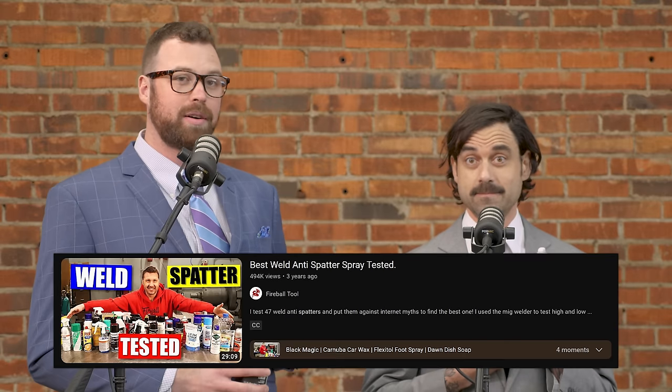What anti-spatter spray do you guys like? Pam? No, come on. Weldmark by Dynaflux is my personal favorite, followed closely by WeldAid if you can't find Weldmark. There are lots of anti-spatter sprays out there — these are two that have worked really well for us. Shout out to Jason over at Fireball Tool, who's done a large comparison video of anti-spatter spray. Go watch that. This is available at Arc 3 Gases locally, the Weldmark Dynaflux. Steve picked up some WeldAid Nozzle Clean number two from another welding supply shop. Anti-spatter spray is typically only used for MIG welding, although you could spray it on anything you'd like. It helps mitigate spatter from the MIG welder sticking to your piece and or the metal table, but it doesn't interfere with the weld at all, so it's a really good product to have on hand.